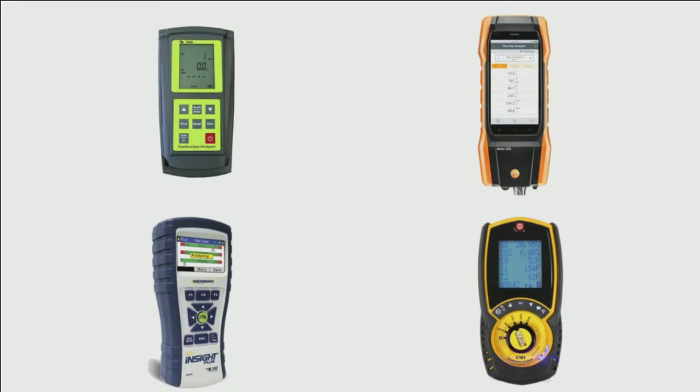High dollar. But with anything, guys, you get what you invest in. So if you want something that's entry level to get used to it, there's nothing wrong with that. If you want something that's upper line, that does all kinds of stuff, there's nothing wrong with that either. That's personal preference, as long as it does carbon monoxide, oxygen, flue temperature, and it is a strong analyzer.